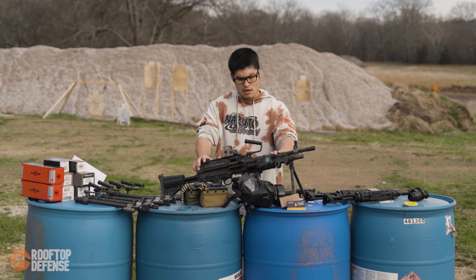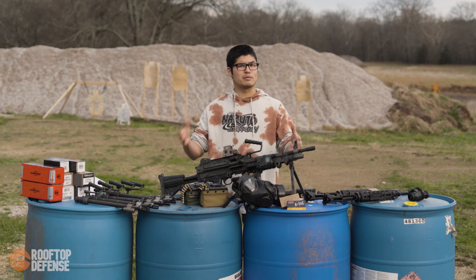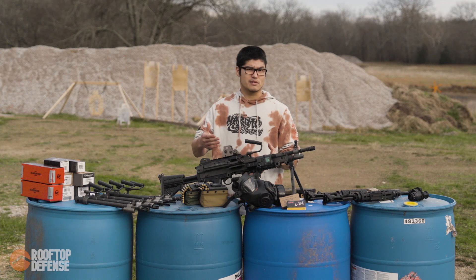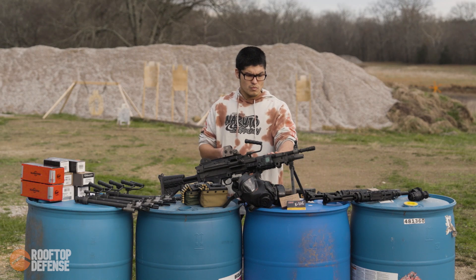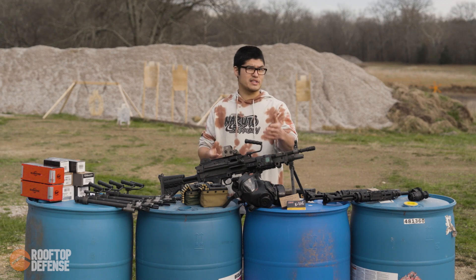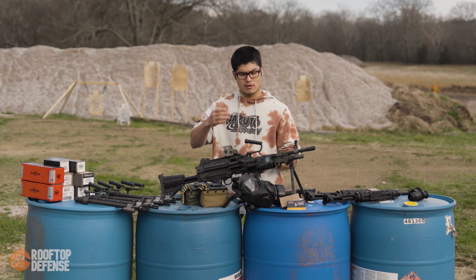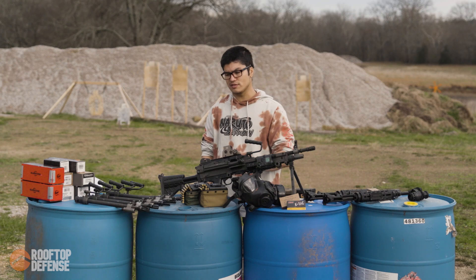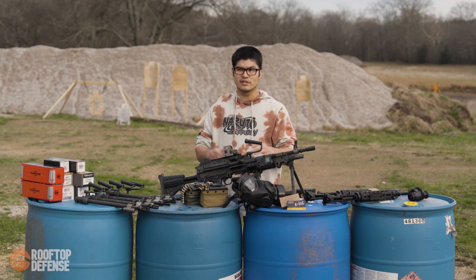The M249 host is a good choice because it gives us a large sample size. We've got a 100-round belt. We'll establish a baseline of unsuppressed rate of fire over 100 rounds, then compare that to 100 suppressed rounds and see how fast the rate of fire speeds up — or how little it does. It's a little exaggerated compared to an AR where you're only getting 30 rounds, or 60 with a D60. With select-fire ARs, rate of fire can also change as the magazine empties. Testing all suppressors the same way — same barrels, same protocols — lets us comparatively say X suppressor increased rate of fire by X amount.